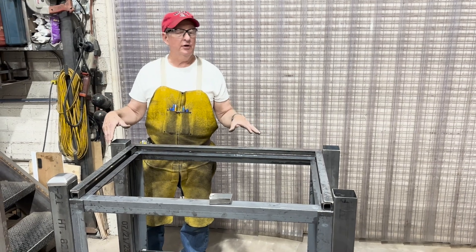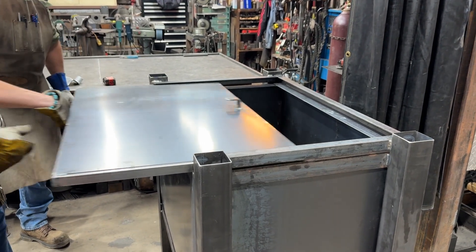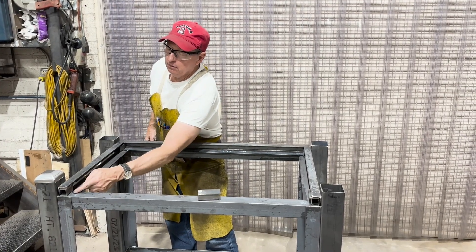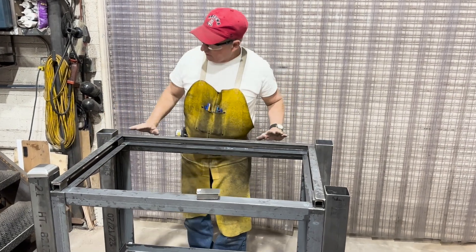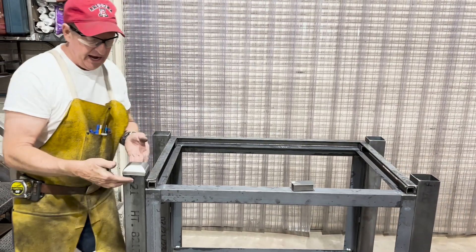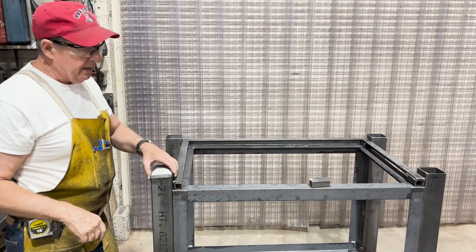This is where the basic structure is welded up and now we're going to go ahead and put in the rails for the lid. The lid will be made out of one inch square tubing with a 16 gauge top. So we're going to shim up above here one and three-sixteenths, so we'll be able to slide the lid along the rails and then we've got our stop back here. We did soften the edges a little bit. This is the little purchase cap that we'll use, and when Shane goes to install this over the backflow he'll fill this with concrete and then cap it nice and neat.